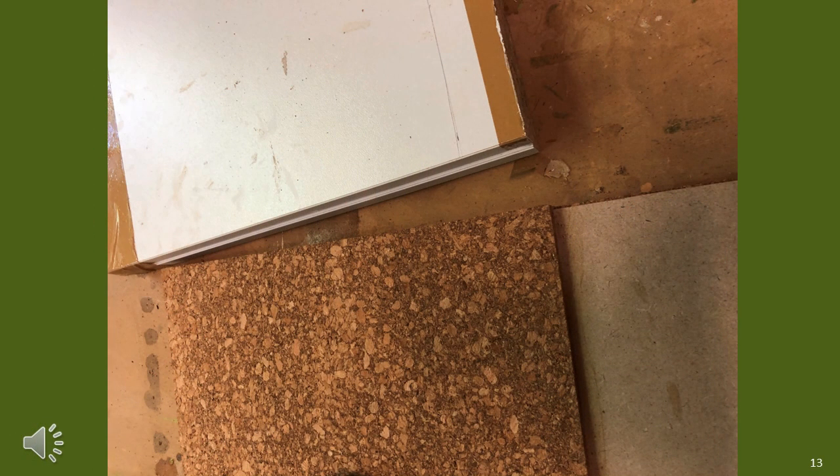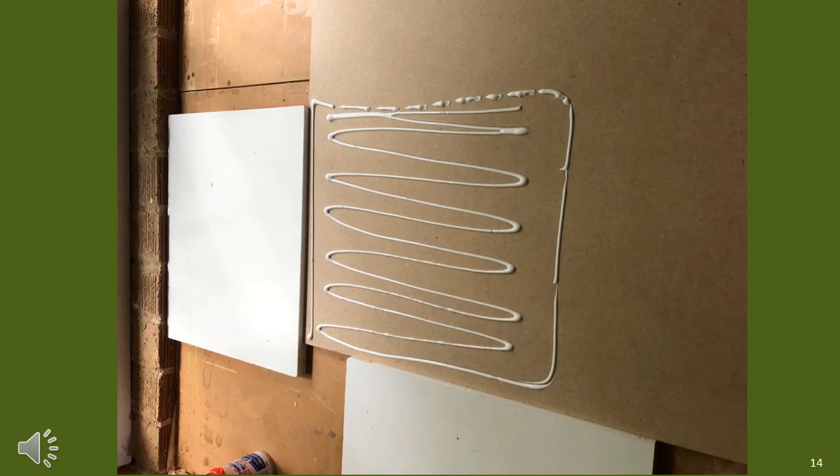One thing you need to focus on is to ensure the tiles are lined up perfectly with the lower tiles. I use a piece of laminated chipboard which is as thick as the 2 cork tiles and the MDF board to help me. Use the edge which is laminated so it will not glue to the cork tile. Secure the chipboard and firmly press the cork tile against it, and then place a weight on top of the cork tile. After a bit of experimentation, this is how I apply the reverse side cork tiles.